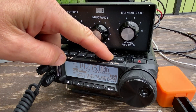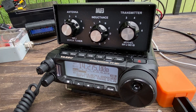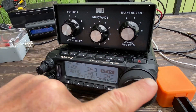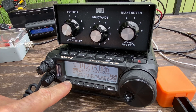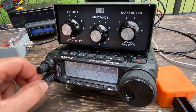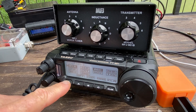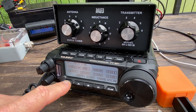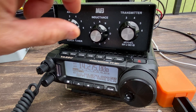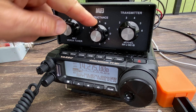What I'm going to do now is tune the radio based on the manufacturer's suggested steps. I'll try to keep my hands out of the way and go to a mode that sends out a side tone — I can also do AM. I want to make sure I turn down power; AM is at 5 so I'm good there. I'll bring that down and take off any filters, in this case the noise blanker.